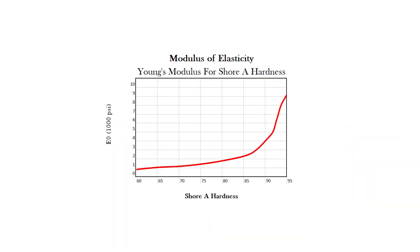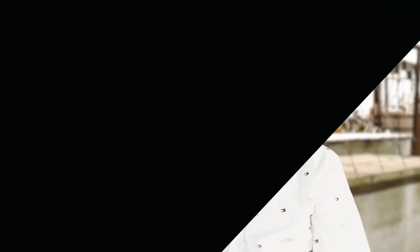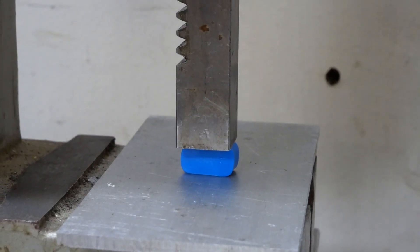Compression and deflection — the biggest part of it is going to be the Young's modulus, which is a number for each durometer that gives you the basis for how to calculate these kinds of applications, to figure out where the sweet spot is and where the safe zone is. When you're pushing, let's say, 20 tons on a piece of urethane with a four-inch draw, you're going to need to know this.